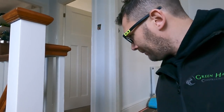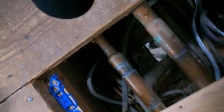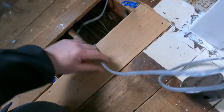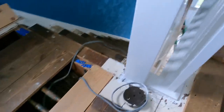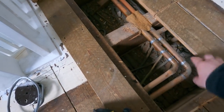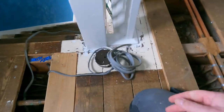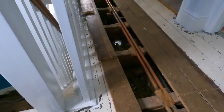So what we were thinking of doing is, if we take out all this old cable that's basically like this, so that was actually underneath the floor, and that leads off, looks like, underneath the bathroom way. So what we're gonna do is try and remove as much of this old rubbish. I mean, what's that for? So like I say, there are some circuits that are still energized, so it's really important to make sure that you test everything before you cut it. And then we're gonna strip it out everywhere that we can. So look here, we've got cables down here, they can all go. There's another bit there that's just been used as a bin. We'll get all that out of the way, and then we can redrill our new holes and get them all sorted. And I think that's just going to be a better way of going about doing this job, to be honest.